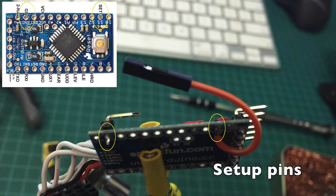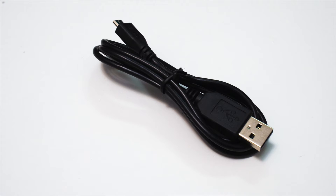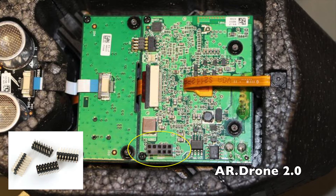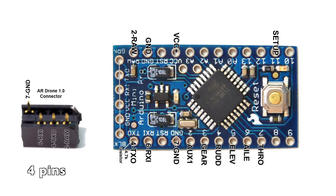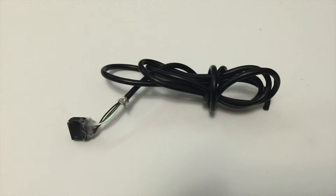In order to set up and test your drone you need to put it into setup mode. Solder a right-angle connector to pin 11 with a removable cable on ground — this way you can unplug it when flying and put it back into setup mode when needed. Next we'll make a cable that plugs the AR drone to your Arduino board. I'm using a micro USB cable, so find one you can cut up. USB cables work great since they have the four wires we need. Version 1.0 has a 7-pin male connector on the board and will need a female header. Version 2.0 has a 9-pin female header and will need male connectors. The latest drones with 5-pin female headers will also need male connectors. Even though the connectors are different, they only use four of the pins. The newer 2.0 drones will require a logic level converter to supply the right voltage, while the older 1.0 drones only need a 4.7k resistor.